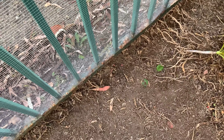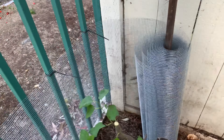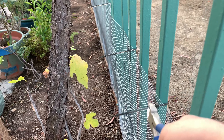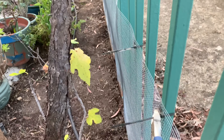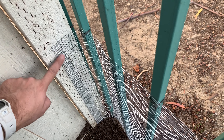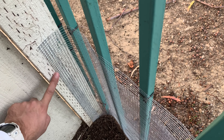I've got steel wire wrapped at the bottom and zip ties at the top end. The end of this fence still has a lot of material left so I'm just going to cut it off with my pincer. Now that I've got all the zip ties on, I'm going to go and cut them off one by one with these pincers, and then maybe pull with needle nose pliers if necessary to tighten the fence. The initial part of the fence came bent, which is actually blocking off the sharp edges, so I'm going to do the same thing on the other end as I cut it off.